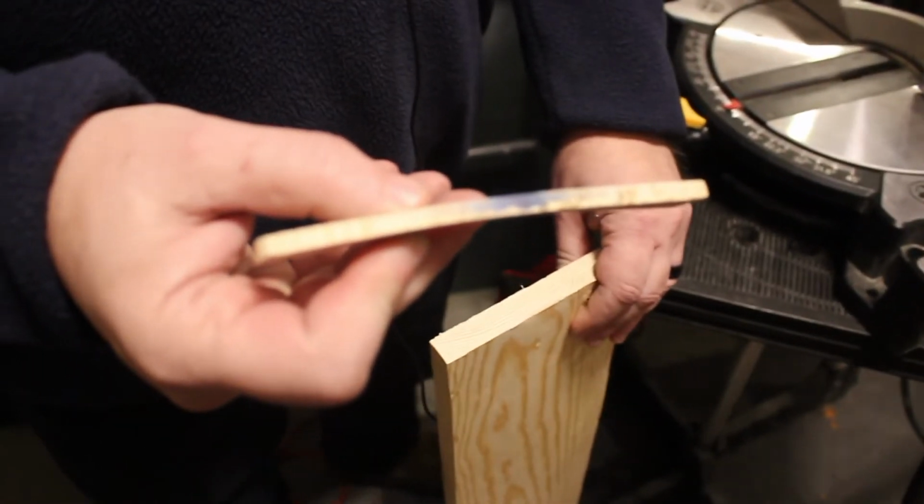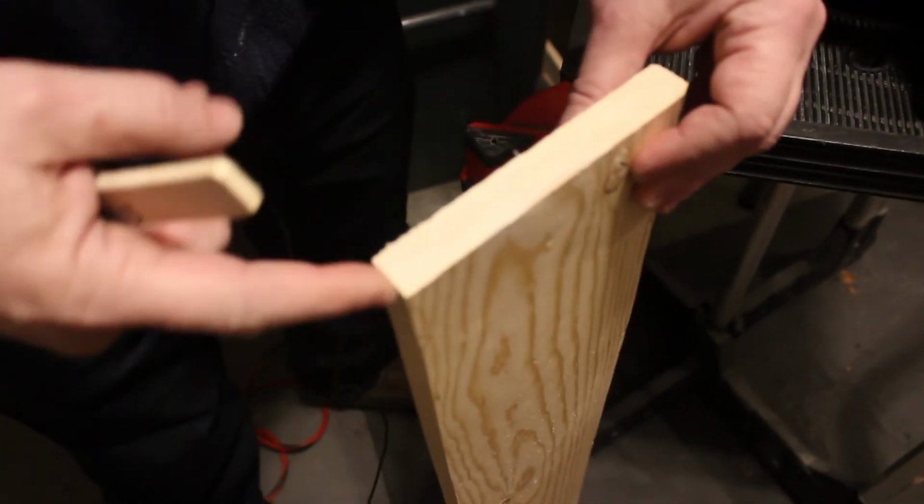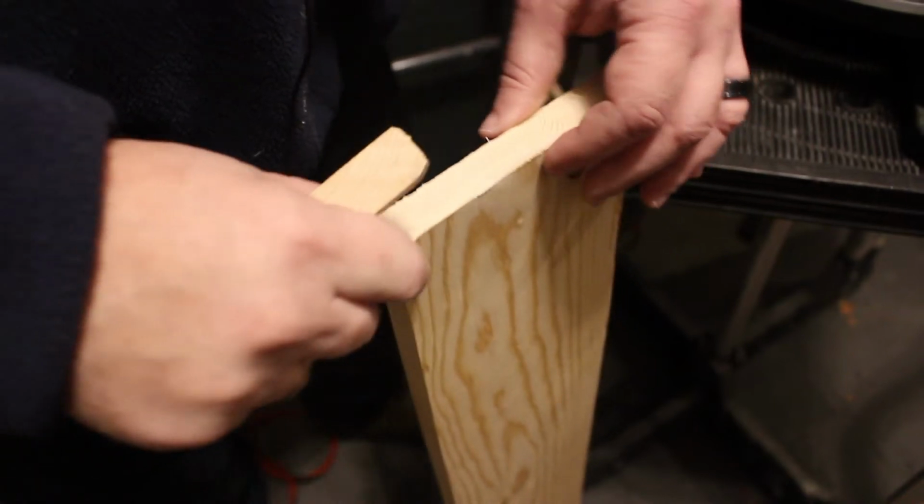And as you can see, we took a significant bow out of that edge piece, and this is now a very straight, nice edge that our next board will be able to just butt against. We are going to use, again, the plywood as a substrate, so we're going to glue one of the surfaces, the one that we don't like the most, that will not be visible. And the glue and the plywood will keep all the boards together and provide both strength and rigidity at the same time. Again, the idea is for this to be an unorthodox build, right? That will require minimum tools. I mean, you will need a saw for sure, right?